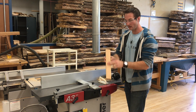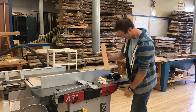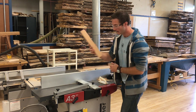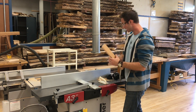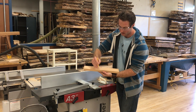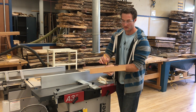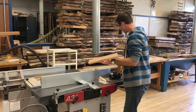One pass — that was actually it. A very shallow pass that didn't need a lot at all. All my pencil marks are gone, they're equal, and it is really nice and flat on the table. Face is done. I'm going to take my pencil and give myself a mark that looks like a six — this mark points to the edge that is going to be my next step.